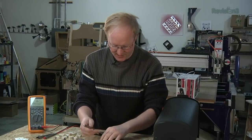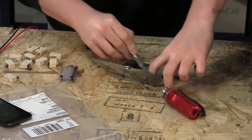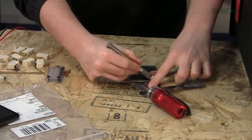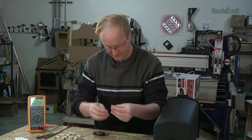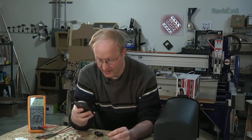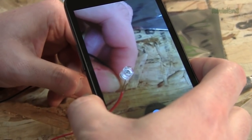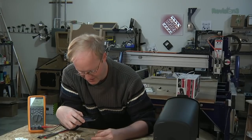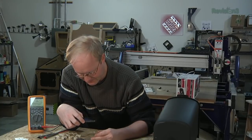Then we have some infrared emitters and detectors. You can't see infrared with your eyes, but the camera can. Let's just test this infrared LED — I'll hook it up to this 3-volt battery and look at it using my cell phone, which will allow me to see the infrared. Almost any charge-coupled device image sensor will see in the infrared spectrum. So we know it works, and we'll figure out the right resistor to use. I'm probably just going to have a 4AA battery pack in this thing.